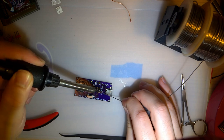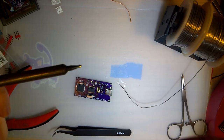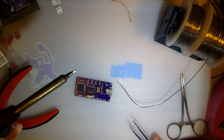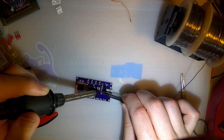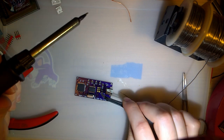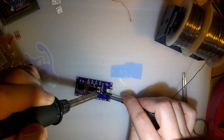This is one of the things that I tinkered with when I got the schematic from HDR. Because, of course, I just have to tinker with everything. I can't leave anything well enough alone, whatever. You know what I'm trying to say. HDR, when he designed this particular cart reader, did it the smart way, and he actually stuck within the specs, such that the CC lines couldn't be routed. You have to break the design rules just to route them. And sometimes that's okay, but not always. I figured I could get away with it. That's why I didn't mind tweaking it a little.